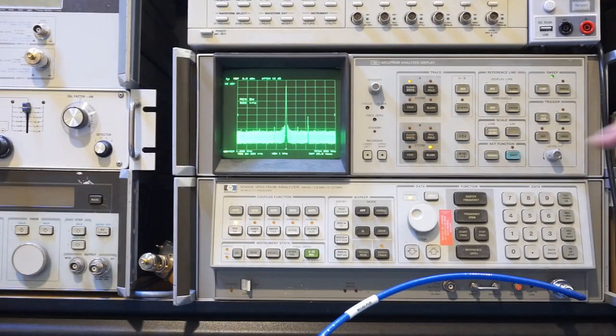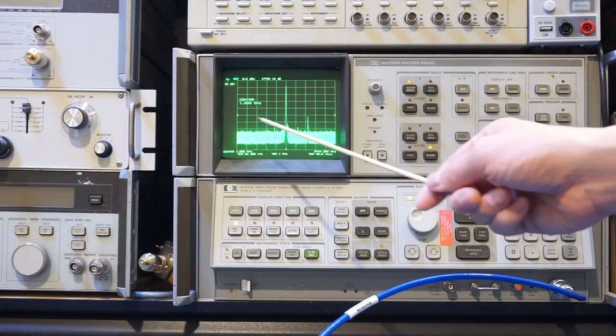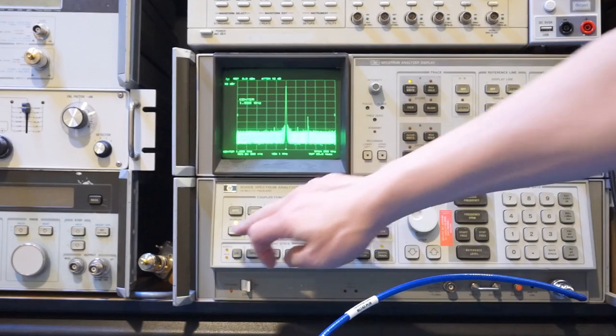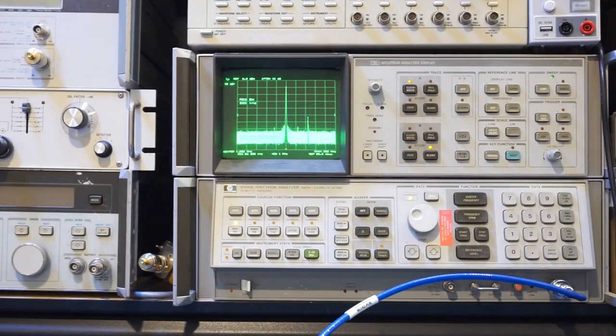Currently, the spectral analyzer has a center frequency of 1 GHz, and we're sweeping between 900 MHz and 1.1 GHz. We also set the resolution bandwidth to 300 kHz, as you can see here. Now, the spectrum is a lot cleaner compared to what we saw in the Nano VNA-FV3, which uses the same synthesizer, so I suspect there was some kind of programming issue in that design, so it can definitely be fixed by a firmware upgrade.